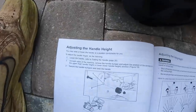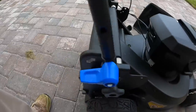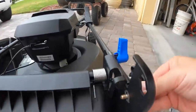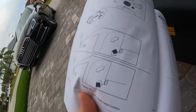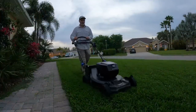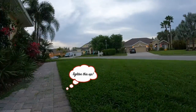So I open up the manual and I start looking to see if I can adjust the rake, and indeed you can. Beneath these rubber flex shocks here — which are nice because they do help keep the mower grounded across bumps — you can take those out and you get about an eighth of an inch of play from up to down. When you move them to the downward position, that eighth of an inch, by the time it translates out to the end of where your hands are, it actually brings them down to a very comfortable position. I felt a lot better at that point.